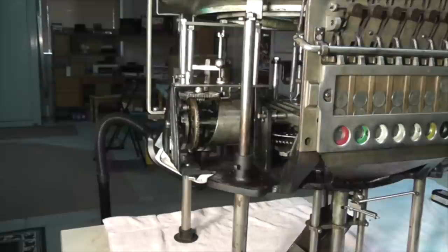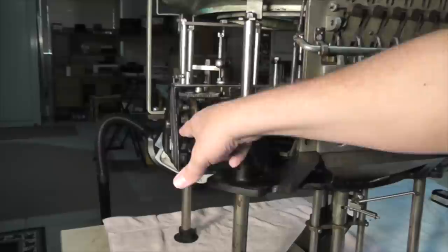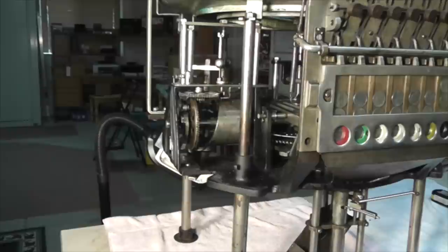catches the ball, which will then cause this little bar to raise up and allow the rest of the machine to cycle through the payout detection phase, which will then allow the horizontal payout levers to lower down, and if it's on a color that was selected, will cause the timing mechanism to cycle. So I'll go ahead and cycle it a couple times at this angle, and then I'll zoom in.